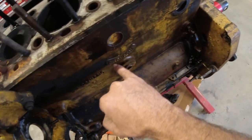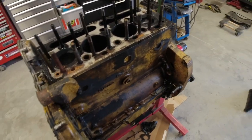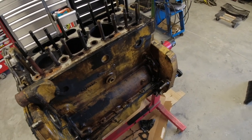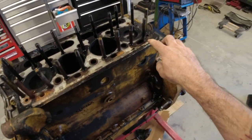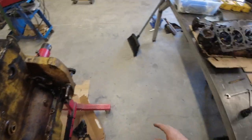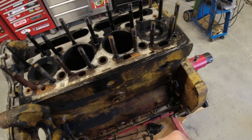But this engine is very difficult to remove - as you saw, we had to remove the entire front end of the tractor. There's no guaranteeing that the weld would last, so that's not a great idea anyways. What I would have to do is have that hole machined so I could fit a new freeze plug, and then have the weld area machined down. The company that does my cylinder head servicing here in Spokane doesn't do engine blocks, so I would have to take it to Castle Engines - the guys that rebuilt the 454.